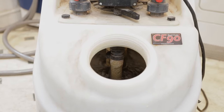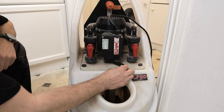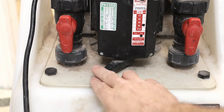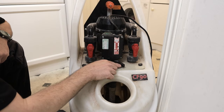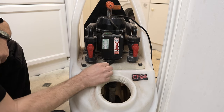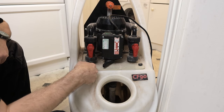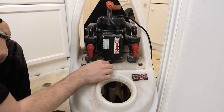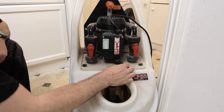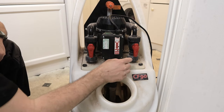So let's have a look at this machine and I'll explain exactly how it operates. At the front of the machine we've got this valve that moves from right to left. It reverses the flow — in one position the machine pushes water through here to the system, if I reverse it it pushes water through the other side. By quickly changing the direction of this valve we change the direction of water in the system, creating turbulence and picking up more debris.